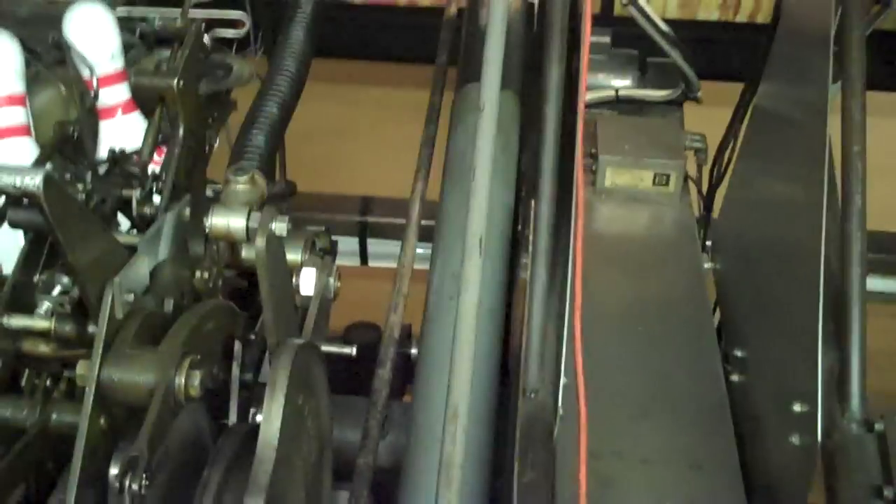If you look here, I have the machine at 45 degrees right now. The sweep length and the crank arm are in a straight line, so that's as far forward as the sweep length is going to go.